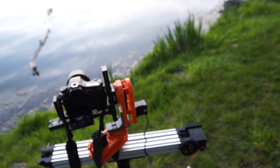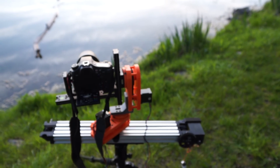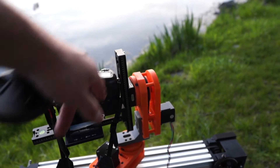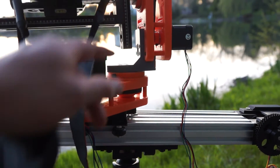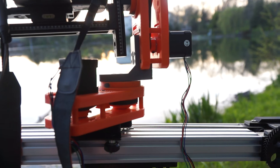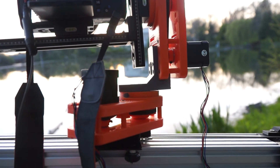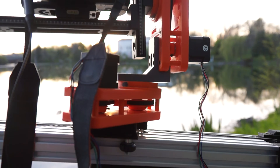Everything else seems to work — it's fairly slick and compact. It gives you a little bit of motion; my other slider is six feet long which gives you a lot of motion, but this is a heck of a lot more portable. There are commercial units that do this that are more rigid. When I did the original design for the pan and tilt, part of it was plastic — I swapped that out with metal, and I have a metal bracket I'm going to swap in. It's nice to have 3D printed parts but I don't want to sacrifice stability. I have a little wobble at times that comes from those mounts and the plate mount, but it's a work in progress. Until next time, thanks for watching.